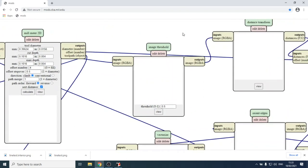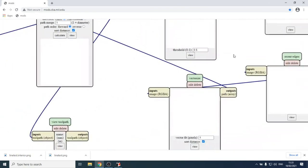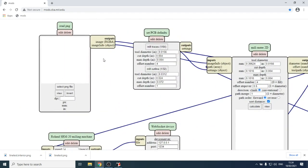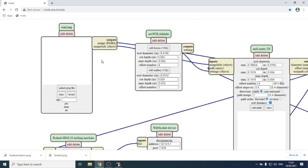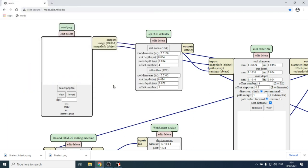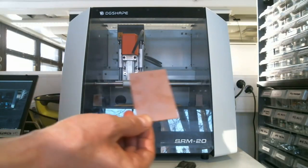The intention of Mods is to let you follow each individual step in the process of generating toolpaths for the machine. Toolpaths are basically vectors, and you use an image to produce these vectors. Start by selecting the PNG file — the line test PNG — and upload it. The concept is that white areas are the ones we want to leave.